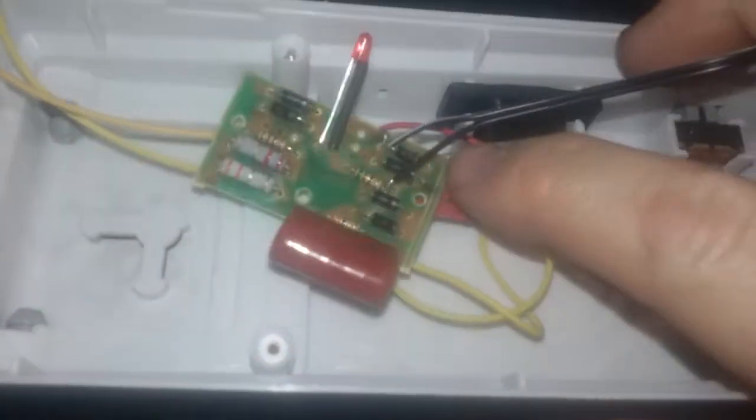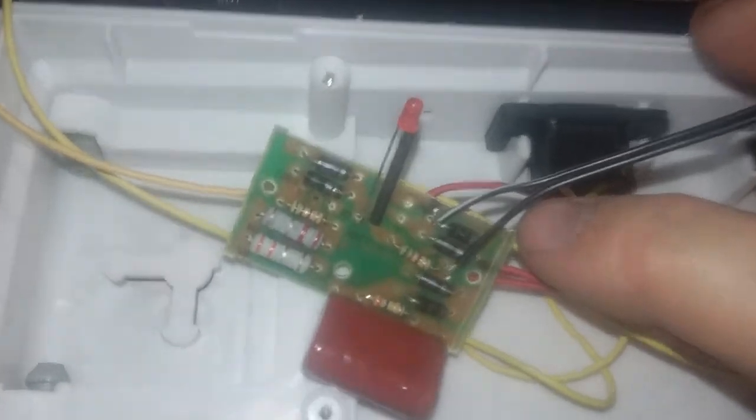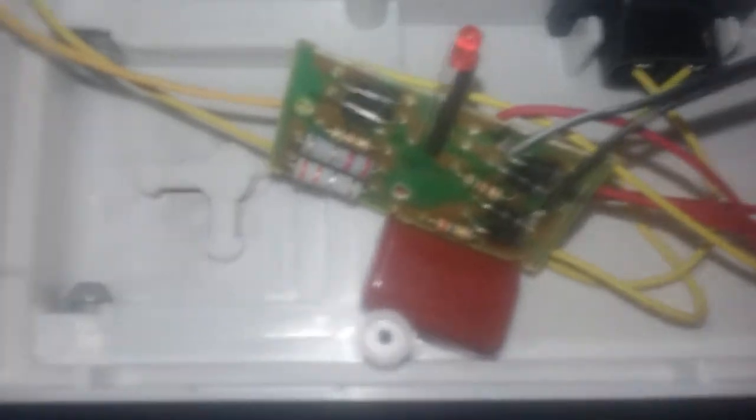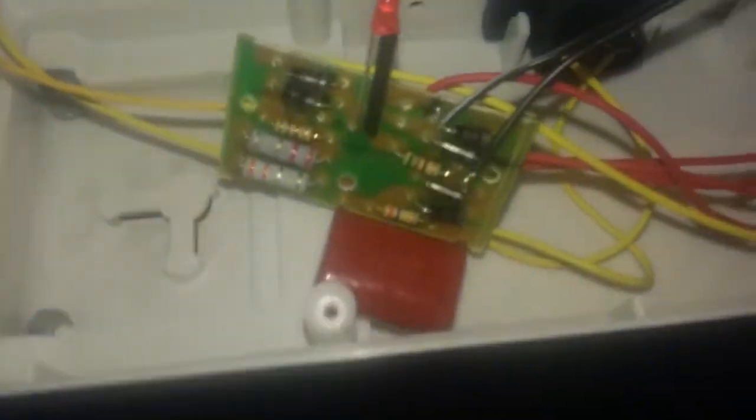So that's what it looks like inside. There's no logic — it's just one of these things. AC comes in and goes through that, gets rectified and converted to DC, I'm assuming around five volts. I currently have made an adapter from an old cell phone charger that I'm going to use on this because it works quite well.